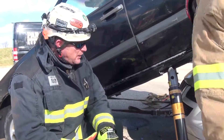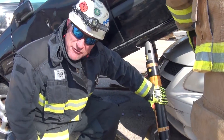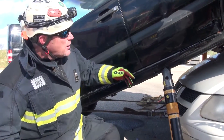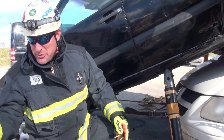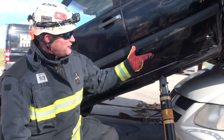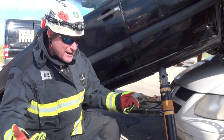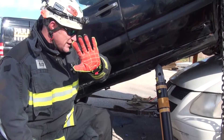So when we're ready to lift, we're going to use the Hydrofusion which hydraulically lifts the load — a 20,000 pound lifting column. We're way in excess of what we're lifting here. Theoretically, this is a 2,500 to 3,000 pound car. We're only lifting a portion of it, which is a lighter portion. So when you think about pivot point and lifting point, you can always use a half coefficient. At a maximum, we're lifting about 1,500 pounds. So we're well engineered. Our ratchet straps are all 3,300 pound or greater, all meeting the requirements of even a 1.5 times coefficient. So we're engineered very well — good load triangles, we're ready to rock.